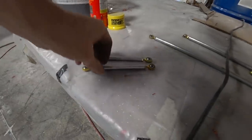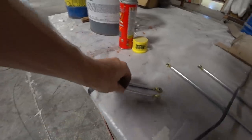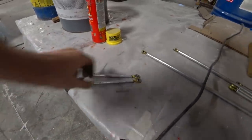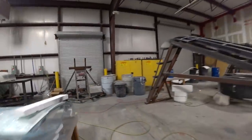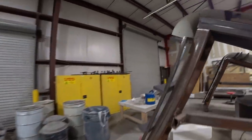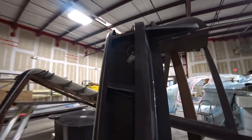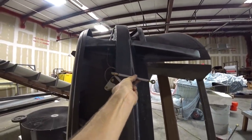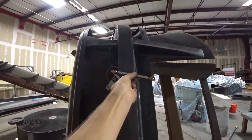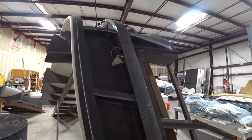I also did the little short pushrods for the rudder controls. They're made out of aluminum as opposed to the other ones that were out of 4130. Walking over here — there's the wing and the winglet, and up in there's the bell crank. There's just a pilot hole right now going through the spar but there'll be a larger hole. A cable pulls on that bell crank and hooks up to the rudder — that's how the rudder gets actuated.